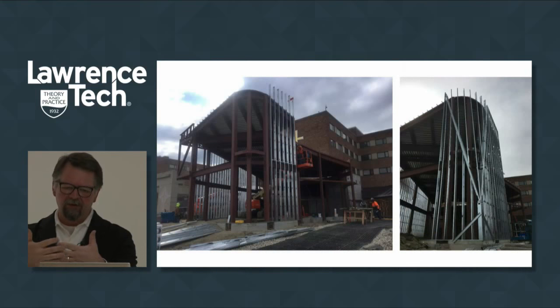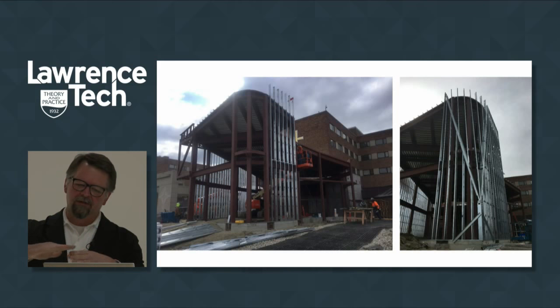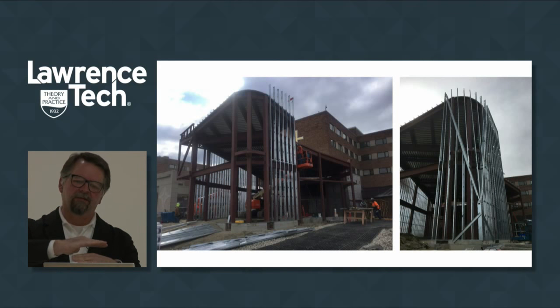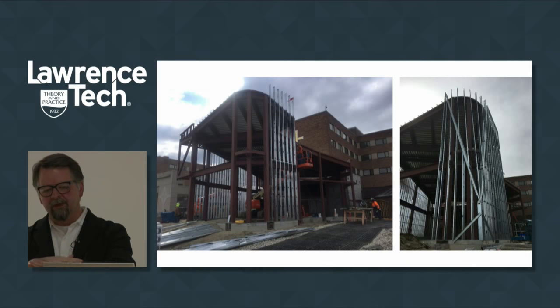So as it turns the corner, we just said we'll delay the rotation of the brick just slightly. And so it's starting to pop out a little bit as it goes around the corner in sawtooth. And then in the next course, we would do that in the opposite direction. So the brick starts to make a kind of brick weave in the pattern, but it's there just as a result of the geometry interacting with the brick itself.